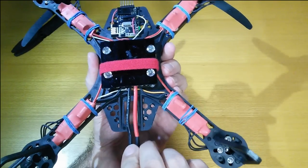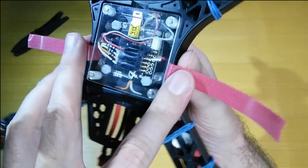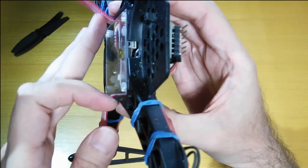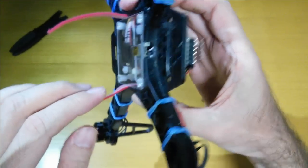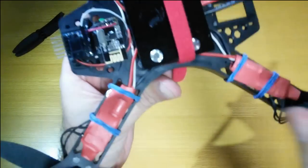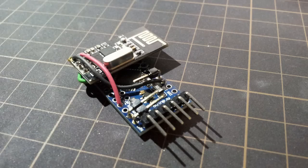The brains of it all is on this side inside a plastic case — that's a CC3D, otherwise known as the OpenPilot Copter Control board, which was about $20 or $22, very cheap for what you get. It connects to a computer via USB, so I cut a piece out of the frame so the USB cable can still fit in there, even cutting the plug part to keep it narrow enough. I drilled some holes in the bottom to run cables through to power the Arduino.